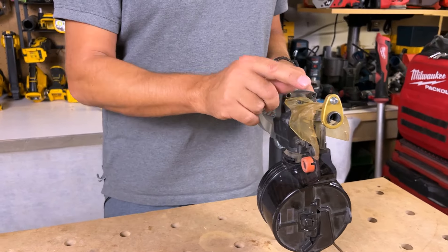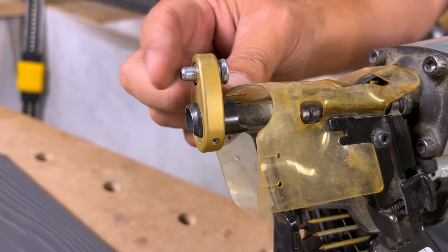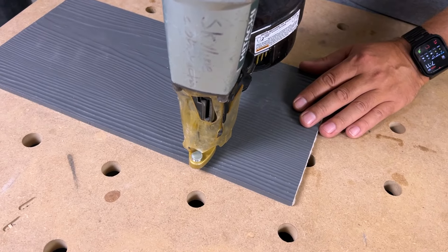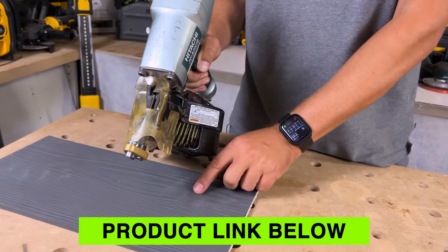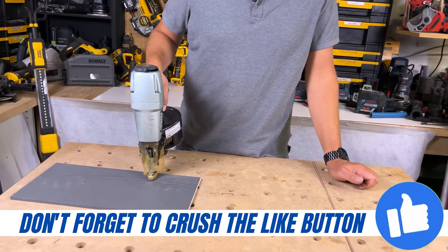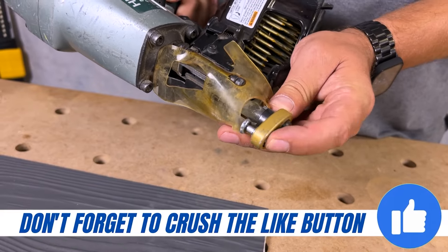It's really important because they will not fit. The way this works is it has a little pin on the top here and you just hook that on the top of your siding, press down and fire. It's setting the nail about three-quarters of an inch down from the top of your siding. And if you need to do any face nailing, you can easily just press down anywhere and shoot because that pin just pushes up, so it's totally out of the way.